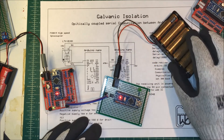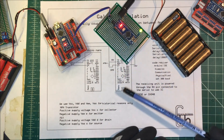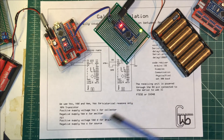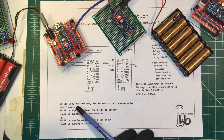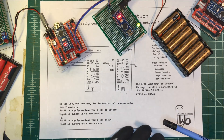One side note: on diagrams you'll often see VCC, VDD, VEE, and VSS. We use those for historic reasons. It started with the BJT transistor — the positive supply voltage was VCC (C for collector) and the negative supply was VEE (E for emitter). When FETs came along, the positive supply became VDD (D for drain) and the negative was VSS (S for source). VCC and VDD are positive; VEE and VSS are negative — that's where they came from.